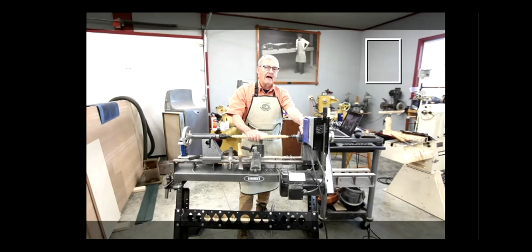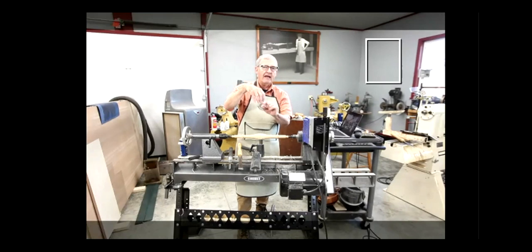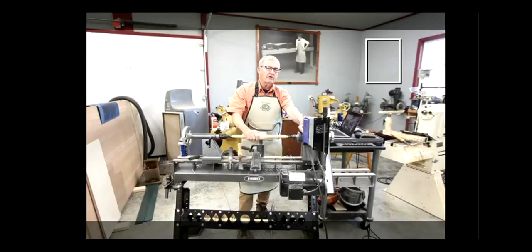Also, I have a number of times over the years been asked to repair some valuable antiques where some turning is badly damaged. And I always try to replace as little as I can. One that comes to mind was a finial that was coming down off the bottom of a piece of furniture. It was a hanging pendant, really. And the end was broken off. I steamed the hide glue, took it off, jam chucked it till it was running true, drilled out the end very minorly, glued another piece of walnut in there, and turned it to look like the rest of them. I then antiqued the piece a little to make it look the same color. And when I was done, it was hard to tell, but we had not completely replaced the turning. We'd kept as much as possible.